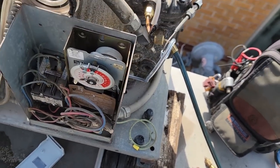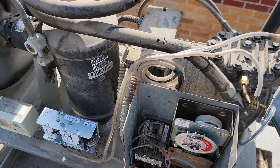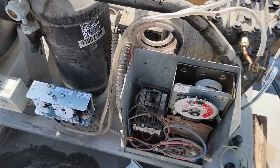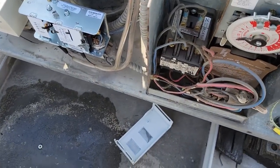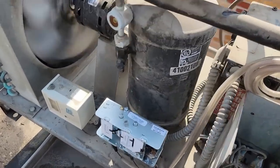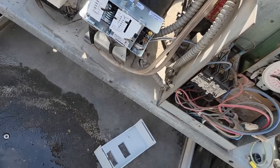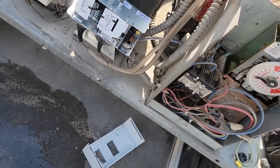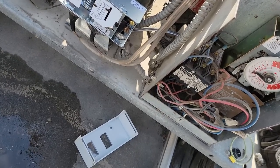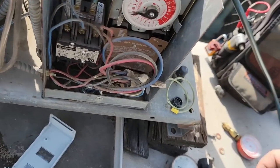Alright, so let's look at a PT chart here, see what 12 would be for a kick on in cold weather. I'm gonna go with our coldest outdoor temperature. Forgot how low 12 runs. Holy cow. So we're gonna adjust this thing somewhere along the 10, 15-ish range for cut in. When you get that low, you start getting into the area where your degrees is your pressure. It's pretty much corresponding together. So let's see how that comes in there.